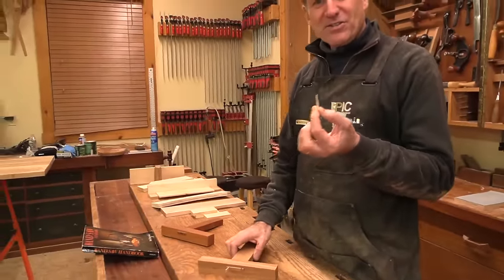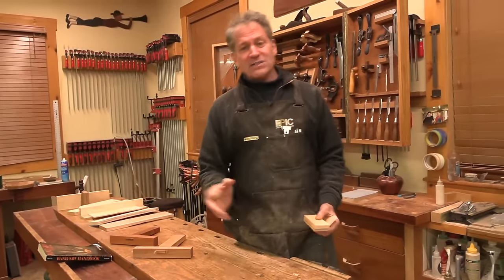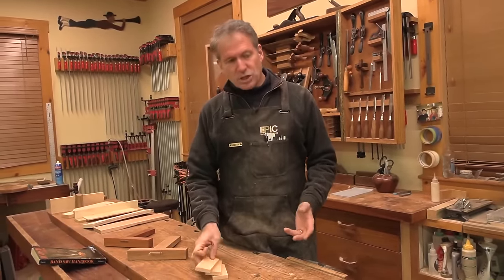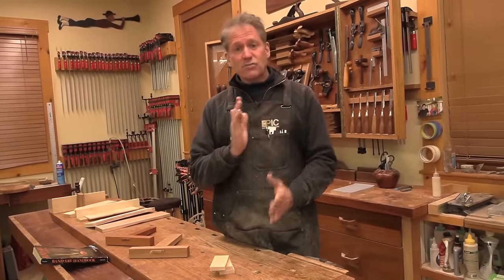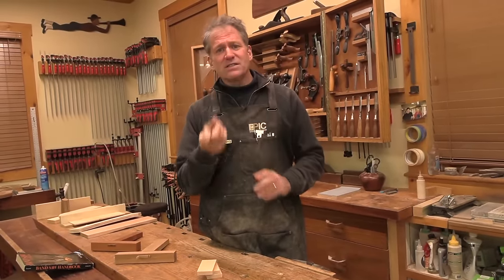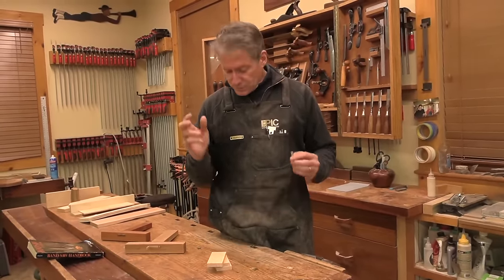how do I make such a small, quick thing like that? Well, I'm going to show you how. I always just knock these out fast on the bandsaw. The bandsaw is really a remarkable machine in the shop. It can cut straight lines, curved lines, resaw, tilt the table, cut angles, so many things. And with different size blades, you can make tiny little tight curves. It's probably the most versatile machine in the shop.